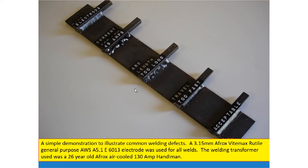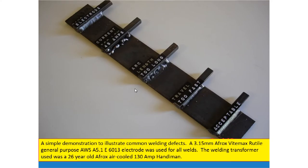The next part shows us the types of welds and defects in SMAW. There are two things you must control: the amount of current and your hand movement, which controls the arc length. If your hand moves too fast or too slow, we will see different results in weld quality. The arc length refers to the tip of the welding electrode — lifting it increases the arc, dipping it into the joint decreases the arc.